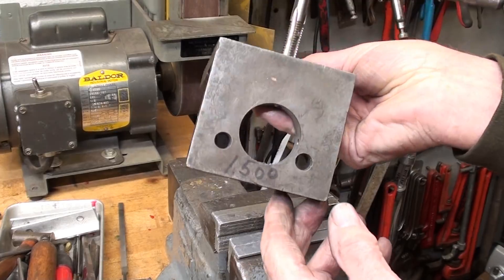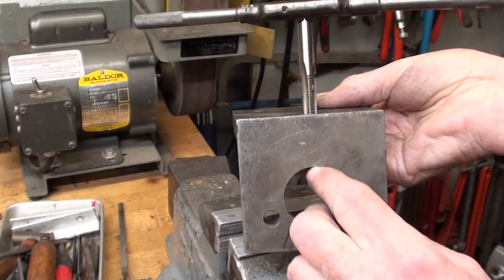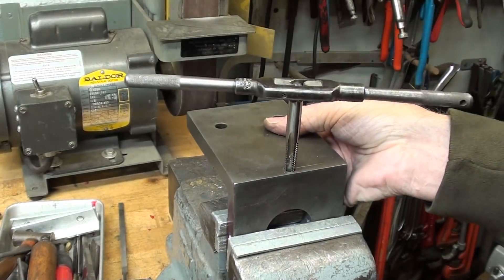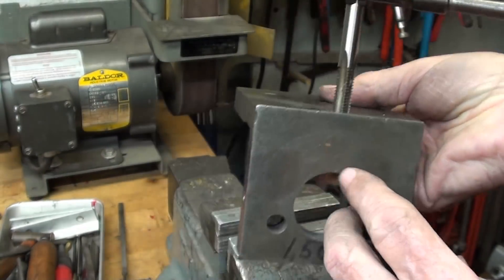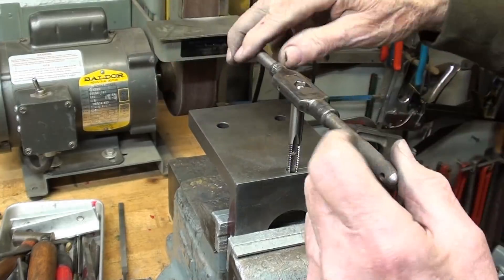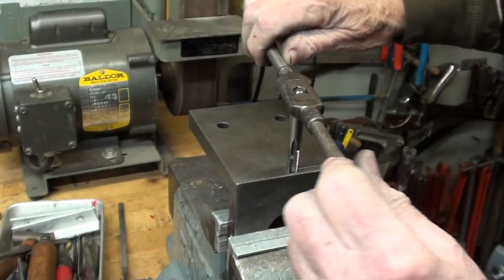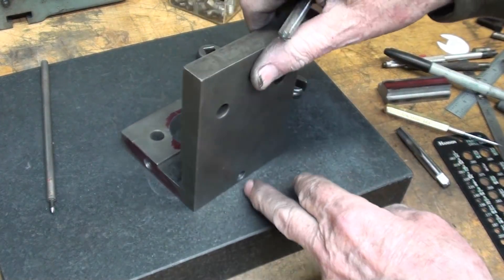I had just a little change in plans — I determined that we just don't have enough meat right here, so I'm moving it to the backside where there's plenty. That's the hole I'm working on. These will be about the same — they've only been drilled a quarter inch as a pilot drill. This is a tapered 3/8ths tap and I'm only going to go in about where you see that mark, then back it out and run a bottoming tap in to that depth. This is the nicest gray iron the way it machines, drills, and taps. About an hour later and I have all three holes drilled and tapped.